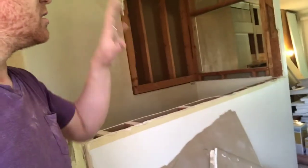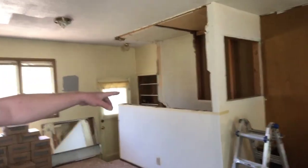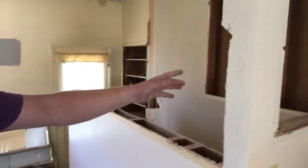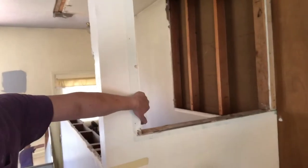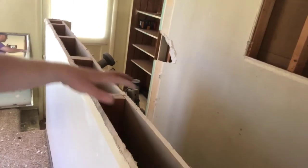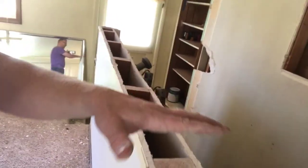Clean this up, clean up the mess, and I'll be back. It has been a really long day — I started this at 7 o'clock this morning and it is now 11. I am done ripping out. So this is what we've got to work with. I'm going to have to trim this up — this is just drywall here that needs to be trimmed up. This window needs to be framed in, so I'm going to frame this opening in so that'll make that a flat wall. Then I'm going to have to cut cripples — filler pieces of two by fours — and stick them in here. And then we'll end up going over this with a cap when we're done.